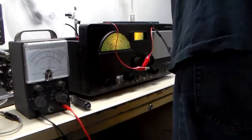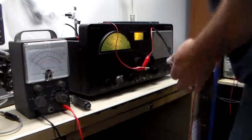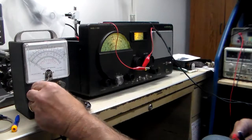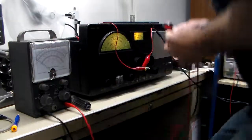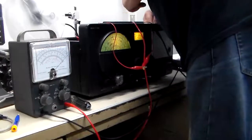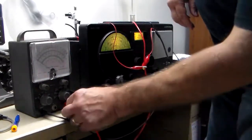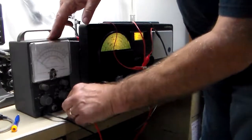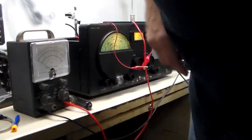That's not going to work because I don't have an isolation transformer. If I even think about connecting the ground to it, it immediately drops down. Rather than waste all this time, I'm going to pause it until I find something that'll work better so we can actually see what's happening.